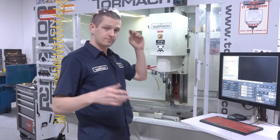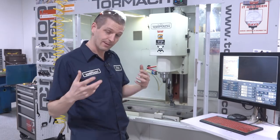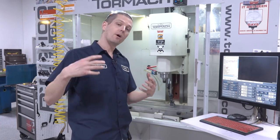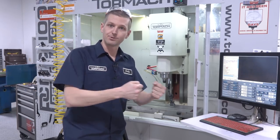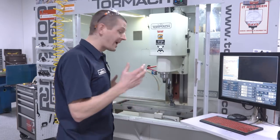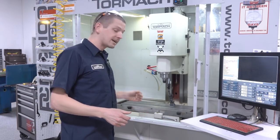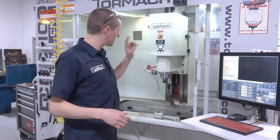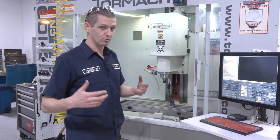I want to maximize surface finishes and tool life. There has to be some amount of give in this machine — that's something I didn't understand when I started, and I think some people struggle with it too. They expect this thing to be totally seized up and perfectly locked and rigid, but for it to move, it has to have some amount of slop. Hopefully after watching this video you have a better understanding, at least in the x-axis, of how that mechanical system works. What's next? We're going to check the y-axis — same thing, just along the y-axis gib, relatively easy. Then we're going to talk about the head, which gets a lot more complicated with the gib, the weight of the head, and how we diagnose it correctly. Look for that video later. Hope you learned something. Take care.